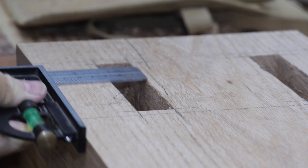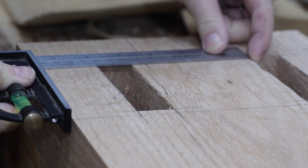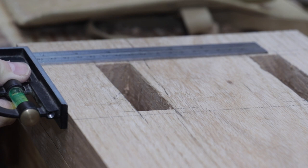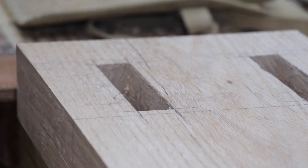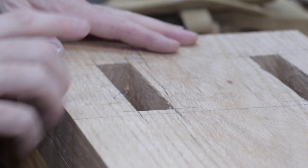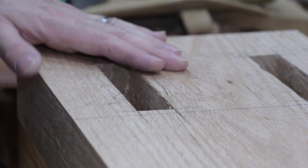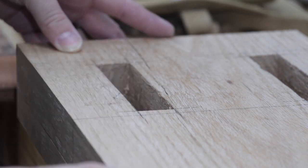I did the same thing for each of the other edges of the mortise — this mark, this mark, and this mark. By doing this, it assures that the mortise position is the same on the number three and the number one upright, so the ways will be in the same position on both boards.